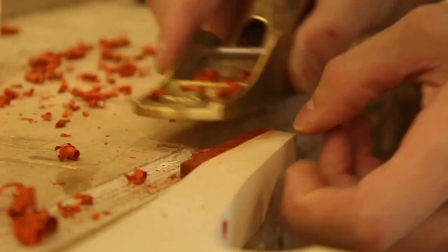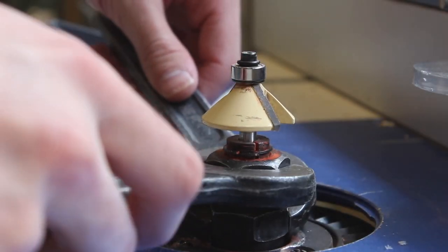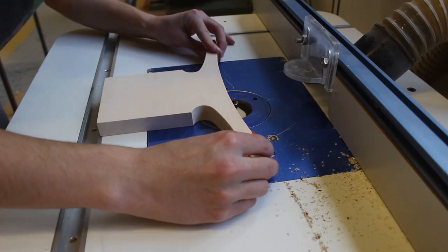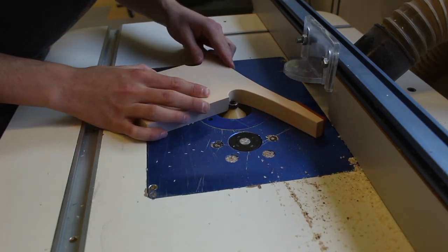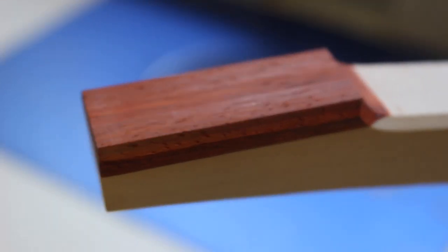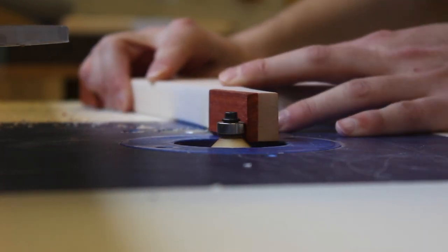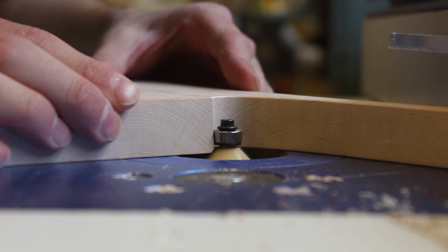Now it's time to add a lovely chamfer on all the edges of the rail. I did this in multiple passes, raising the bit up slowly each time because this is curly maple and I didn't want it to chip out. I'm going in from both directions. Normally on a router table you always go from right to left so the router bit doesn't catch the wood and pull it through, but because this is curly maple — especially where the Paduk accents are — I had to go in from the other direction just for that final bit. This was okay because I was going very slowly, holding the workpiece very tight, and most importantly routing a very small bit of wood away each time. If I was routing more, the router bit would have had more material to grab onto, but because I was only routing a tiny bit away, it wasn't an issue.